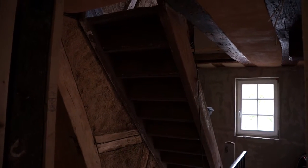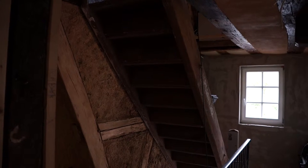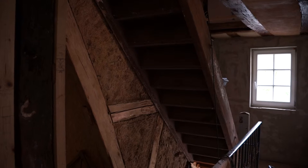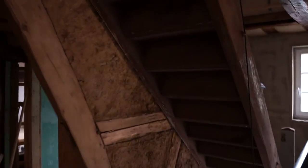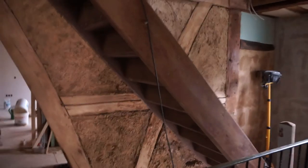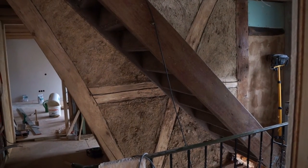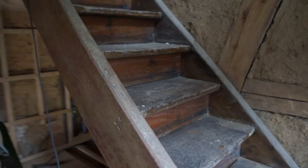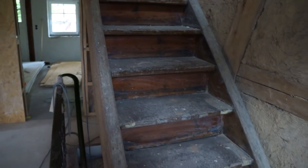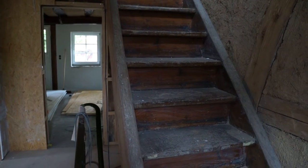Another big change is the stairs. From photos and maybe other videos, people might remember that the back of these original stairs had wooden cladding, so you couldn't see the back of the steps. I was a bit afraid when my wife was taking it off because I wasn't sure what to expect behind it, but it's actually okay. The side parts were painted grey, and my wife sanded all that off yesterday. It's a bit rough at the moment — just to get the paint off — and that'll then go through a fine sanding process. And then it'll be oiled, or maybe some sort of varnish so it's a bit more hard-wearing on the steps themselves. At least that's more of the dusty work done.